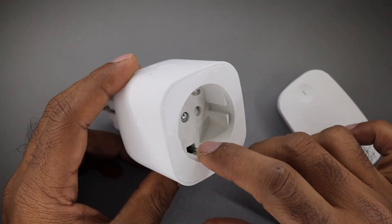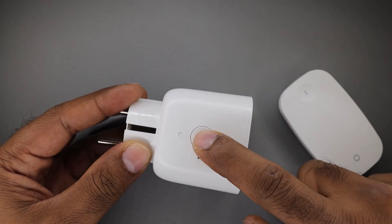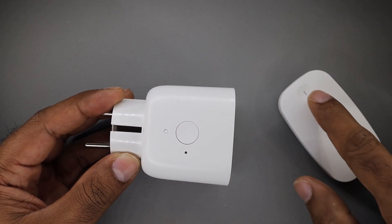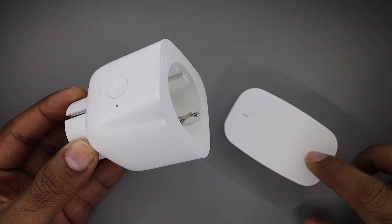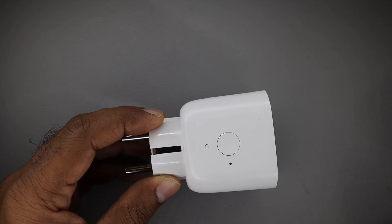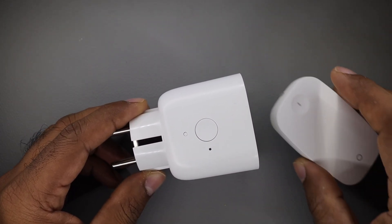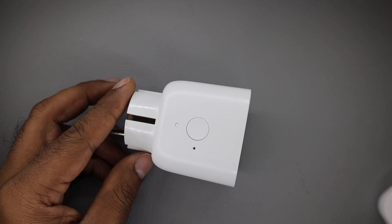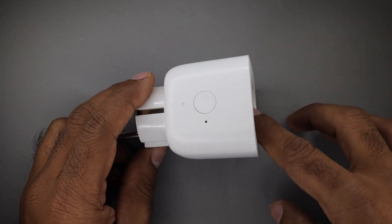You can see on this side is the output and this side is the input. You plug it in the socket and you can operate it with this button, or you can also press this remote button. This remote is paired with this particular device and you can turn it on and turn it off. This unit has a relay inside and operates on the basis of the remote — it's just a switch. It can also be connected to the IKEA hub and controlled by many sensors.